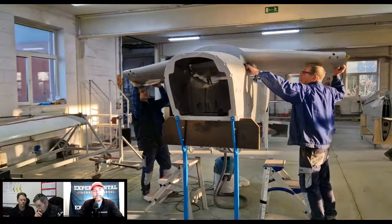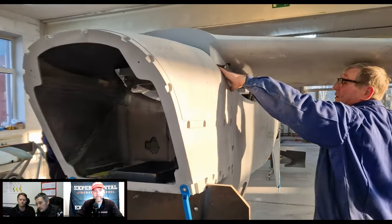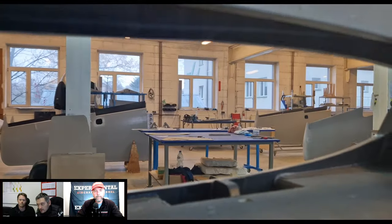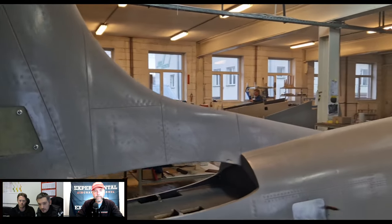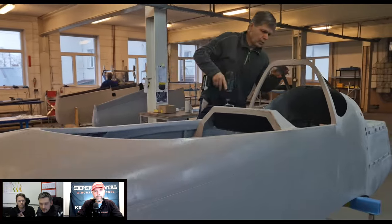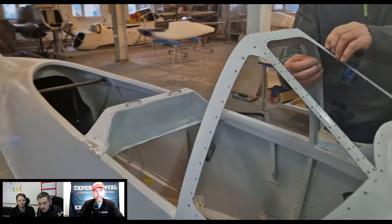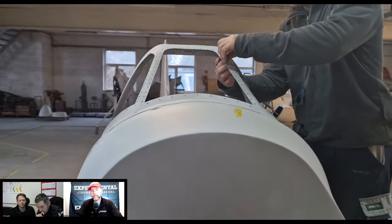No, generally, as an example of the fuselage, the mold is divided into two pieces, the left and the right, and all these rivets, screws, and so on are shaped on the wall of the mold. And we laminate first one shell, then another shell. We glue in all the inside structures. Then we close the molds and glue them all together. And of course, after this, we demold and take it out from the mold.